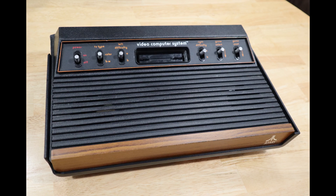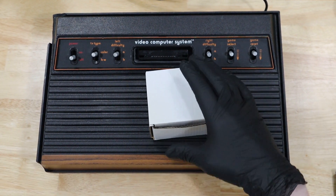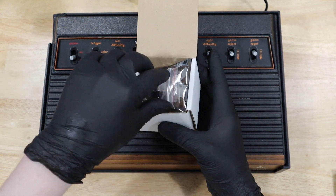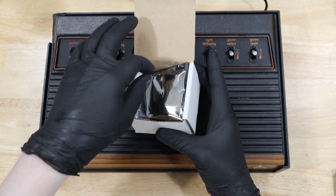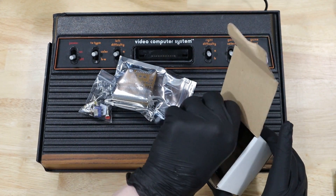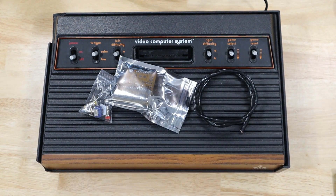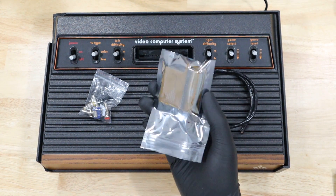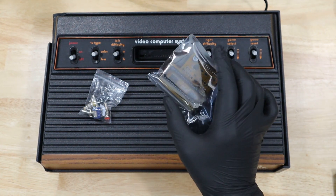Hey YouTube, this is James with Last Dark Games. I'm actually very excited — this is my first console mod I've ever done. I picked up an AV/S-Video mod off of eBay for this Atari we fixed. Normally the Atari only has an RF output, but this will let me hook it up to more modern televisions. I bought the kit off eBay for about 40 bucks and it's supposed to come with everything needed to do this mod. This was called a drop-in mod, so I'm supposed to be able to install this without having to bend any pins or do any soldering directly to the motherboard itself.